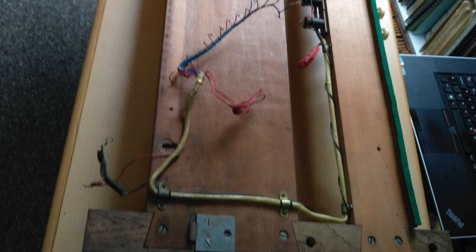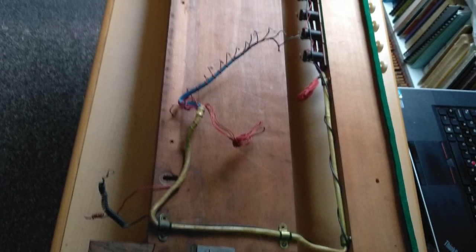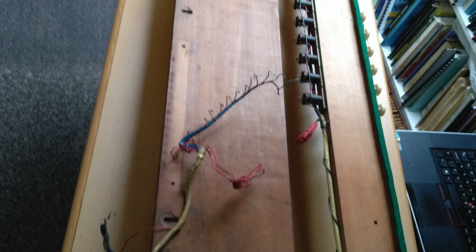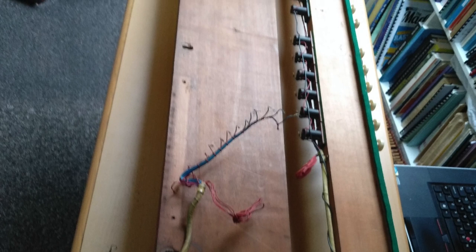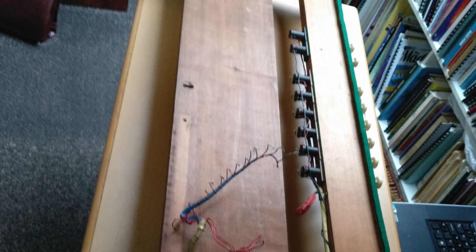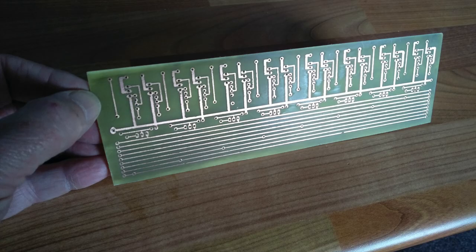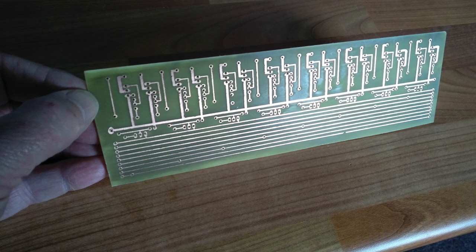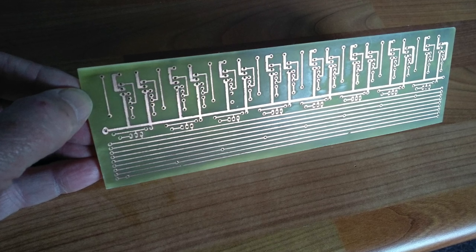This view of the underside of a keyboard shows the rear of thumb pistons and their original wiring. The pistons were disassembled, cleaned and replaced. The original wire loom was retained. The pistons require a higher voltage than the microprocessor which now controls the organ, so a converter board was made.